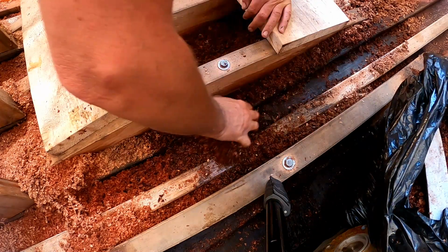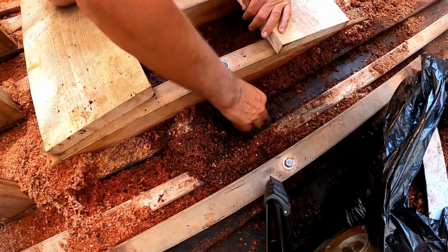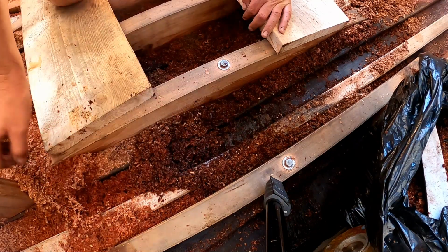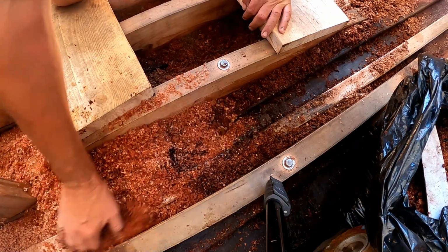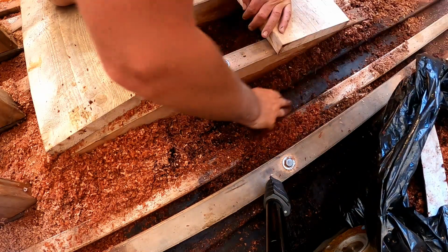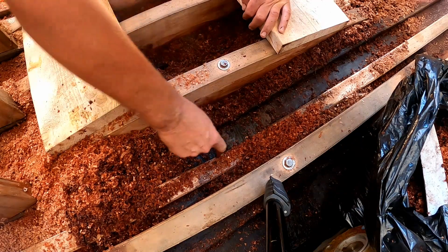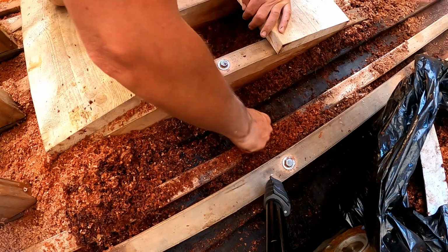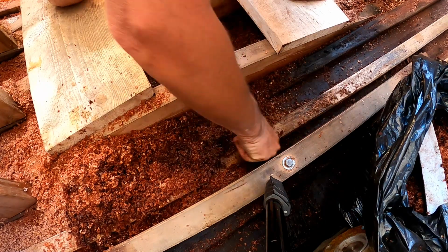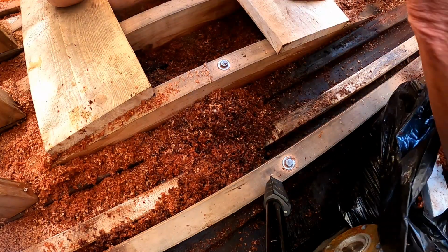Anyway, I don't know if you can remember the massive gap there was down here between the garboard plank and the keel at this location, and it has swollen right back up. Sorry, I just covered it up again, but anyway, there we go. There's the keel, garboard, tight. Now, of course, I must continue to maintain it wet, but I do have to get working in here again, so I've got to get it tidy enough that I can get in here.